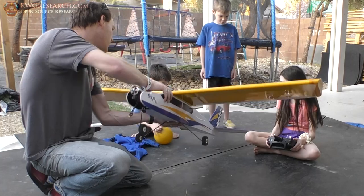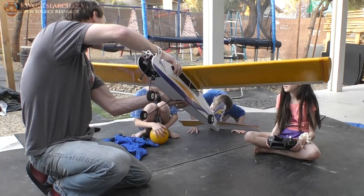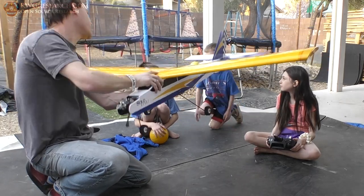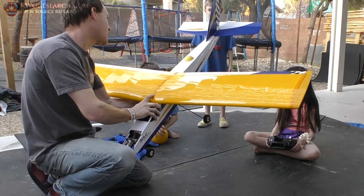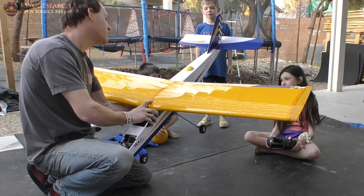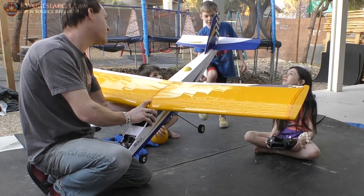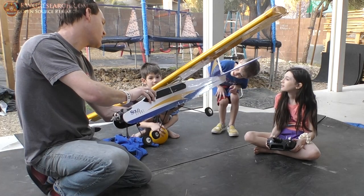Because I got the plane tilted up. So it's going up — it's going to push it back down. If it's going down, it's going to push it back up all by itself. And then if I'm going down and Riley wants to keep going down, she can use the stick to go down — forward, right? See, she's got control. And the ailerons — let's try the ailerons.